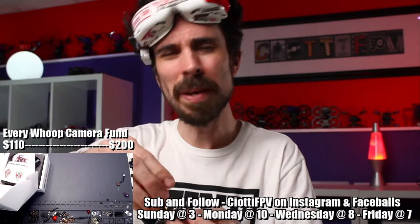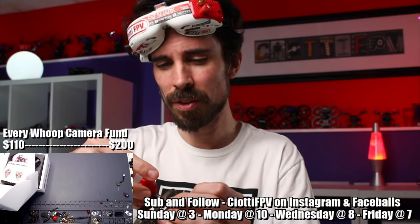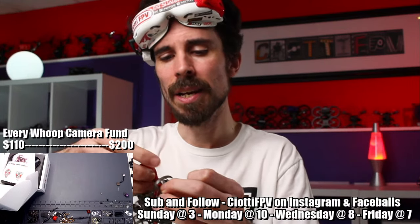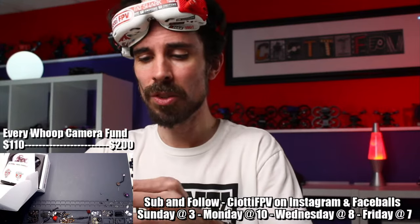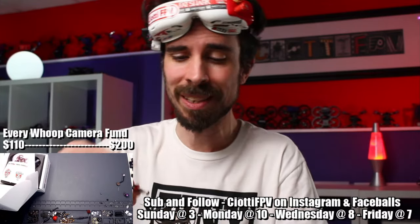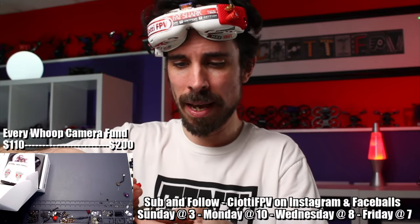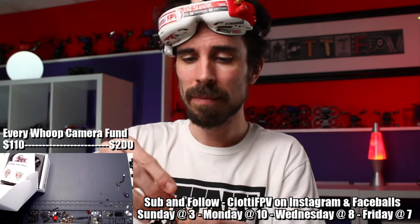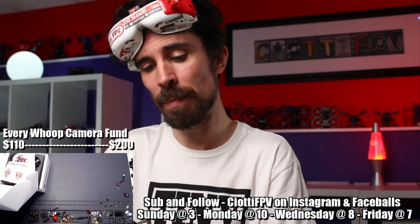What should I put this on first? Let me actually put this onto bi-blades first. 28,000 KV is a little bit less than what I'm used to. So putting this onto bi-blades first is going to give me potentially the least amount of power. And then we're going to move it to these tri-blades, which will make up for that slightly lower KV than I'm used to. Yeah, so this is the prop that I pushed on here.